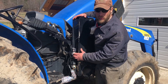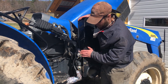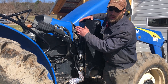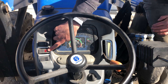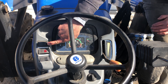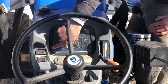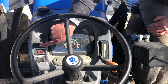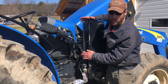Mounted here on the tractor with small welds are two solenoid valves, which we've run to the dash of the tractor with an electronic switch. Prior to operating the solenoid valves that switch between petroleum and biodiesel, we're going to activate the 12-volt heaters on the fuel filter and on the fuel lines. By activating the switch, we have 12-volt power off of the starter that controls both of those modules.